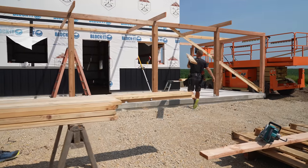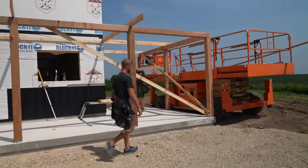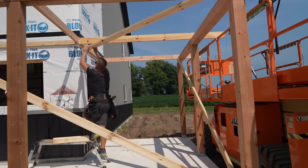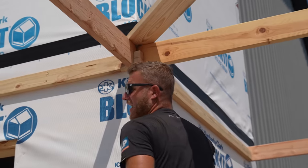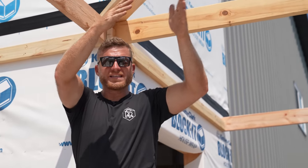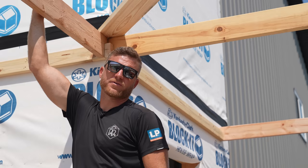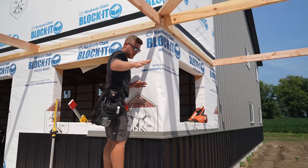This is going to be the fun part — it's always interesting to figure out where the miter out here is. So I've cut this end to kind of go right there. That looks actually really nice. What we need to do is find exactly where the one-foot overhang is out on this corner so we can snap a line across all these bottom ceiling joists.